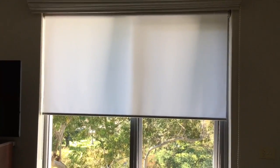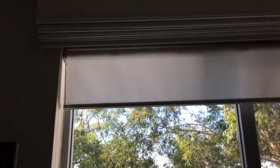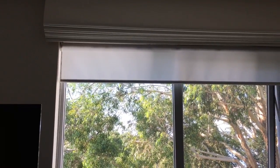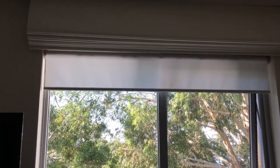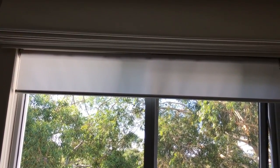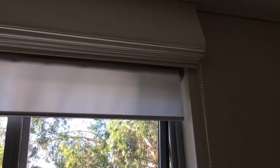Here we have a standard corded roller blind and we're going to show you how to motorize it with the new lithium-ion long-lasting battery-style roller. The existing blind just has a standard cord on it. What we need to do is pull the blind off the brackets on the wall, take out the active end — the one with the blind cord — and replace it with the automated insert. Removal of the old blind is quite simple: take the side that doesn't have the cord and put a screwdriver in the gap between the roller bracket and the blind itself.